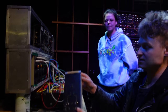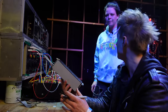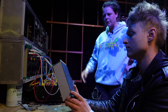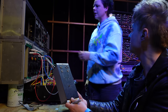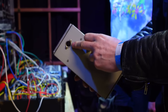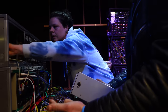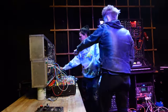The amazing thing about these is they're all in these cassettes. These were off-the-shelf enclosures you could purchase from shops. What Rob said is the stuff that was used was just what was around at that time — look at a magazine, okay these knobs look nice, this box is fitting. There's a lot of space left in the back still, so I'm thinking about making the case smaller, maybe from a different material. The back connection is a seven-pin DIN — that's plus and minus 18 volts, ground, and CV. CV is all on this thing, connecting to the matrix.